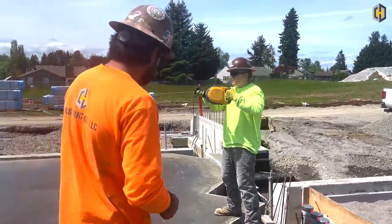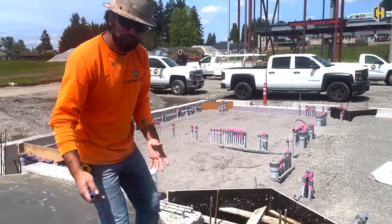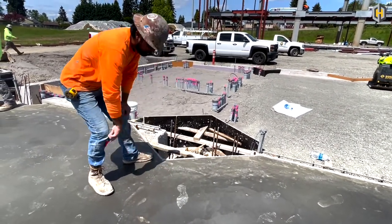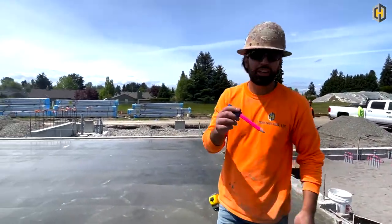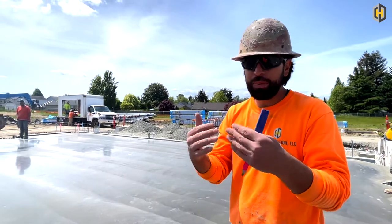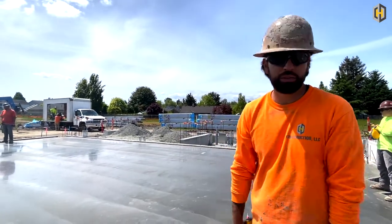Most of the time these diamonds here are diamond blockouts. You can see there's a column in there — they'll set the column in and later come back and backfill the diamond. We control it with the diamond shape here, making sure our joints come off this diamond so the concrete is going to crack there. Also, the rebar was cut every other bar to weaken that joint, to make sure it does crack there. If you saw the rebar videos, you'd notice some bars missing in that area — that's the reason for it.